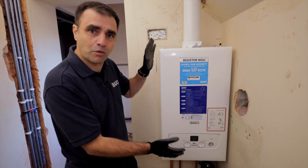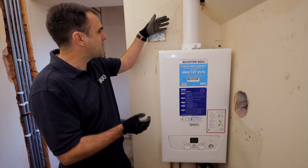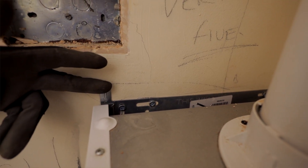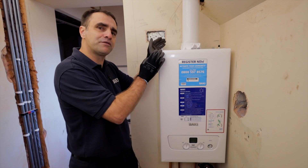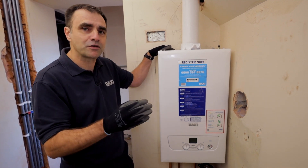As you can see it's a nice compact boiler. Starting at the top we have our central flue, and at the back of the boiler on our simple hanging bracket you can just hook the boiler on. You've got a nice void at the back, so if you want to pipe up behind the boiler you don't have to extend the depth of the cupboard — this will fit inside a kitchen cupboard with pipes behind, no standoff kit required.